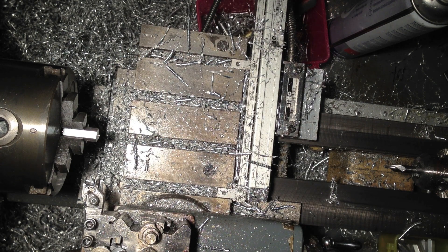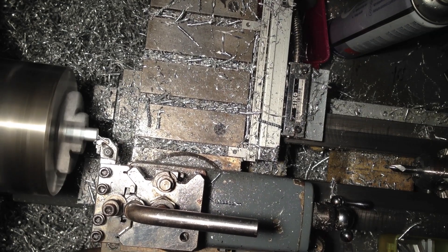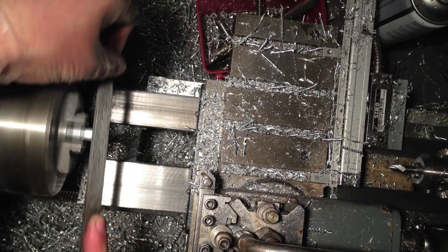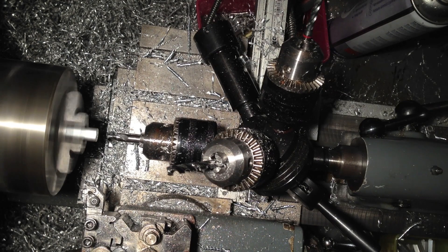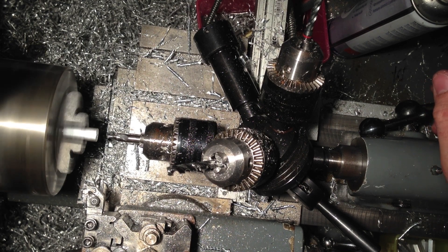Let's say we got a new fresh piece in and on we go. This is the slowest part — bringing the tool in just to get that little tit off, because it's such a long travel on the cross slide. Let's make sure I've got clearance for my quad head. This is a cheap thing from RDG Tools — you can get these off eBay for about 80 quid.